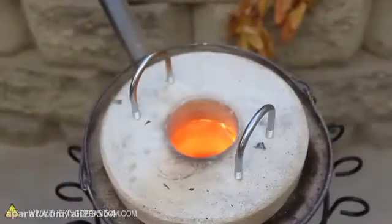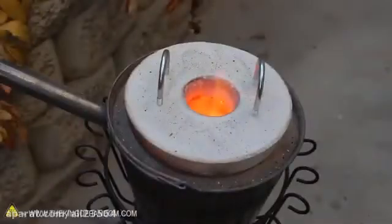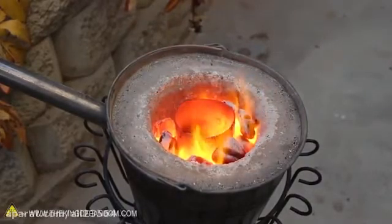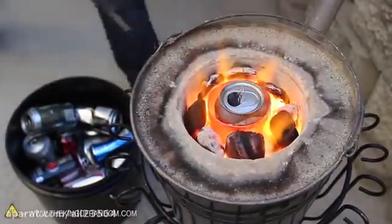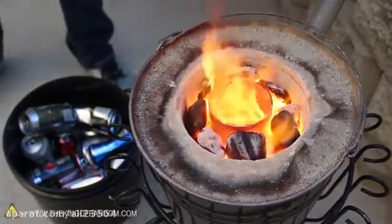After 10 minutes you can see the foundry is scorching hot, and the handles probably are as well. So let's use the tongs to carefully remove the top without getting burned. You can see the steel crucible is glowing orange, and that means it's ready for action. The container is 3 inches wide, which is the perfect size for melting standard sized soda cans. At temperatures over 1000 degrees Fahrenheit, you can see it'll liquefy them in just a few seconds.